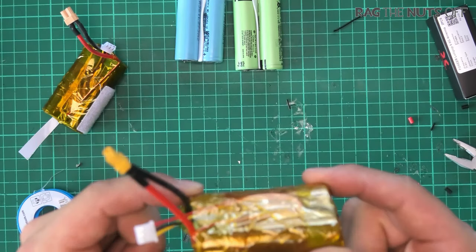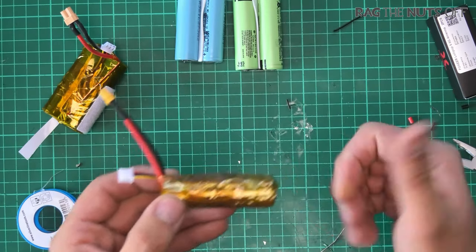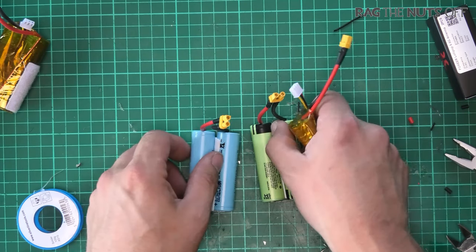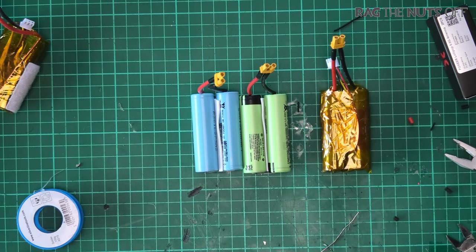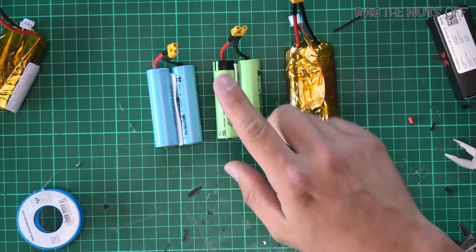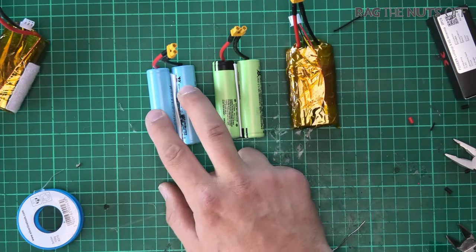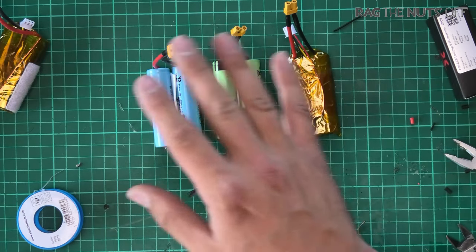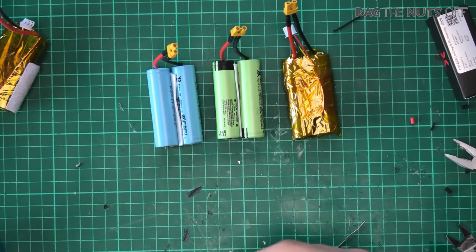I've given it two rounds of tape over the top to squeeze them together, then longer pieces over the ends, and the same on the bottom — that's our pack. In terms of weight: whatever your cells weigh plus about 15 grams. All we added was some wires, an XT30 connector, a balance lead, and a tiny bit of solder. So if your cells are 43 grams each, plus 15 grams, it's not a lot — and that's a 3600mAh battery pack.